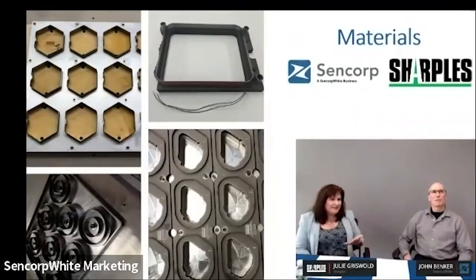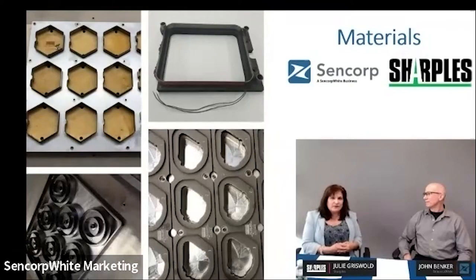Different material bases for dies can be wood, steel, stainless steel, or Rayform. We typically see a lot of wood dies but also a lot with Rayform. Rayform is a very durable material that can be re-knifed again and again, but the best advantage to Rayform in thermoforming is its low moisture content. You can heat the Rayform die—it's very durable and serves its purpose very well for heated trim tools. It is more costly, but it's an investment in getting the heat to the edge of the blade.